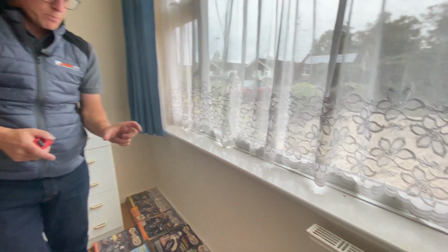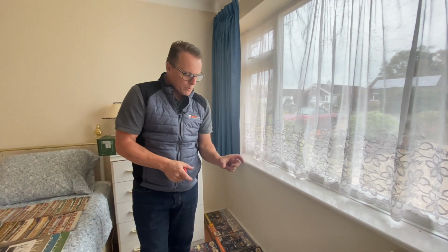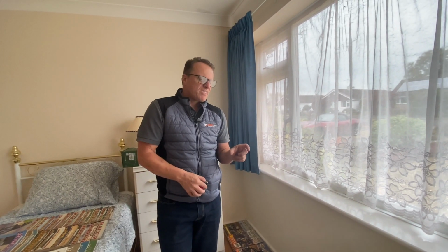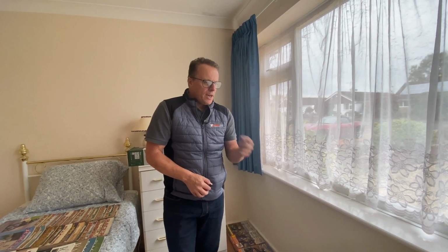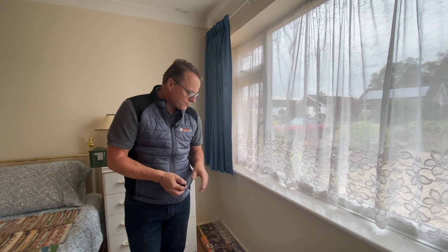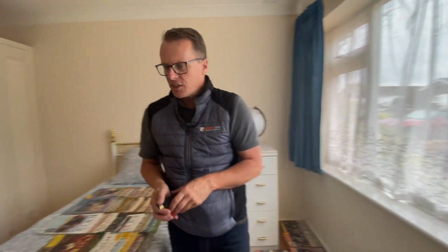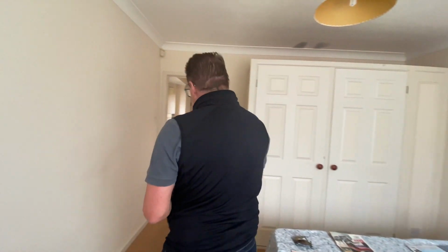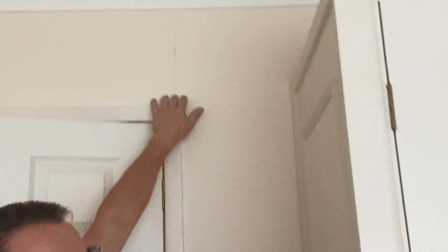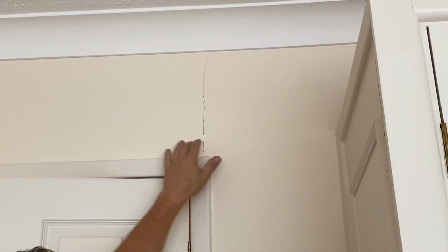Okay, walls. We've already looked outside and said earlier, I think the walls I said were 290 thick, which is 100mm brickwork, 100mm blockwork, internal plaster finishes. So we're looking at a cavity of around 70-80mm or so. And again, as we saw outside, that has been injected with insulation. Walls are generally in okay condition, no real significant issues. We come across little things like this crack up here.